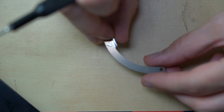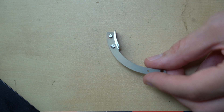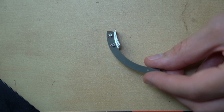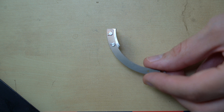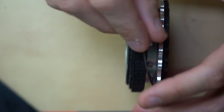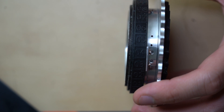On the second part I have already fitted the clamp to our clamp holder. The little copper wires over here are just replacements for the washers I don't have yet. Another change I had to make is that these are actually M1.6 screws and not the planned M1.2, because that's the smallest size I can get my hands on - shouldn't be a big problem. All that's left to do now is fitting our clamps to the sleeve - we have the sleeve over here, just put it in and screw it down - but I'm going to do this off camera because it will be an awfully fiddly job.